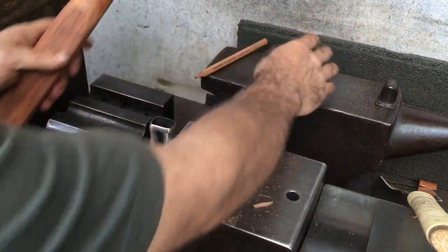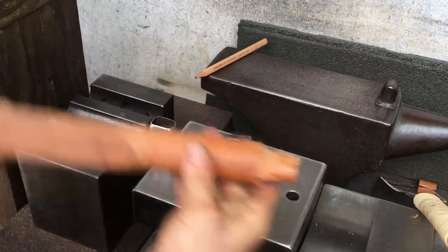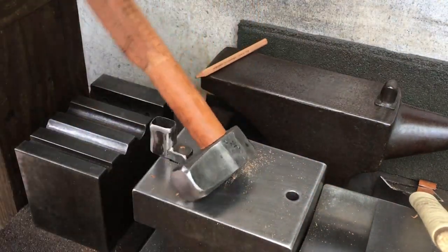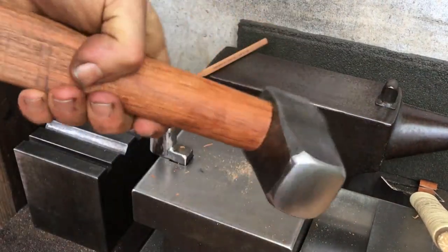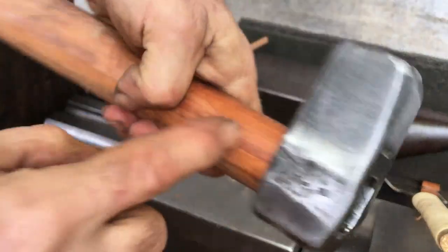This one looks just perfect. If this works on a regular basis, this can be a real time saver for me, not to mention it'll improve accuracy. Once again, I'll bring the wood up in the eye by paring off the shoulders and creating a taper.